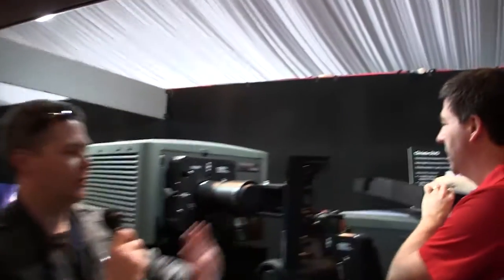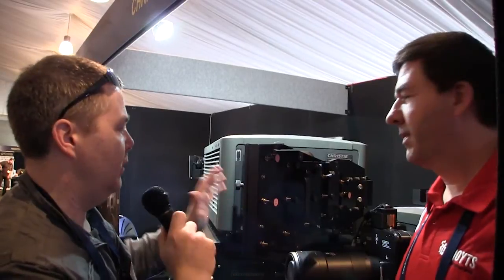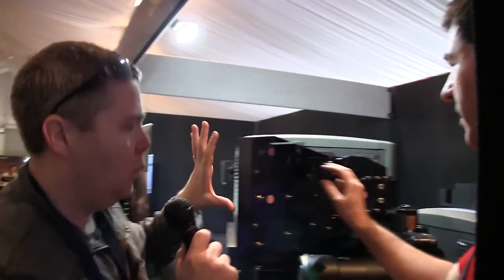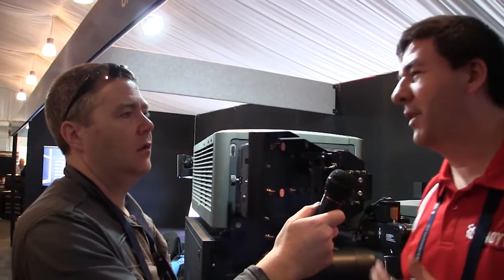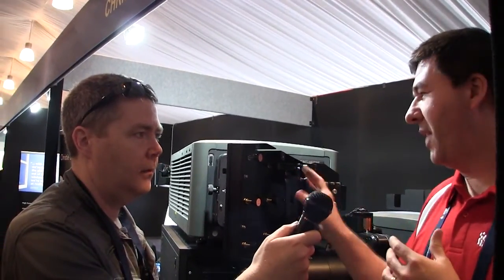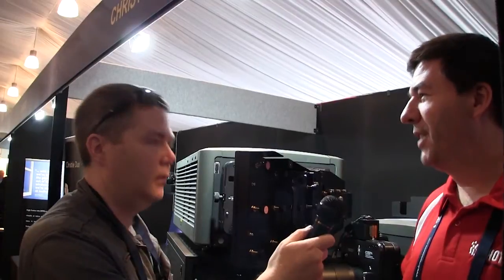Let's have a quick look at the mirror. It's got a protective layer on it at the moment. The reflectivity of the mirror is about 97%, because the mirror surface is on the front of the glass rather than the back like a normal mirror, so the light doesn't have to pass through the glass — it reflects straight off. These are all the adjustments which allow you to warp the glass to exactly match the image of the first projector. You may not think the glass would be that flexible, but some of these adjustments can move the image a couple of meters up and down on the screen. By locking three of them down, it gives the others the ability to warp various parts of the mirror in different directions.